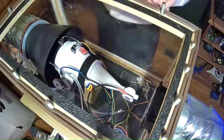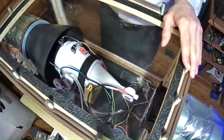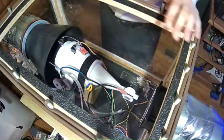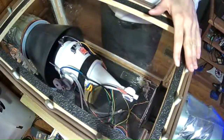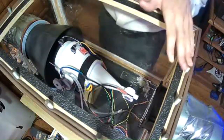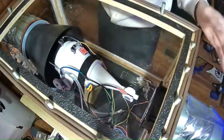With the Peltier modules, the cool thing is that I can control it very well with the computer. I'm going to use a potentiometer, a digital pot, and an H-bridge. The H-bridge will switch the polarity so that I can cool and heat the box on demand, essentially. I can tell the computer I want to cool the box. I don't have to switch anything. The computer can control it. And the digital pot is going to be able to throttle the Peltier modules by lowering the current flowing through them. And so I can effectively maintain a very well controlled climate inside this chamber. And there's a lot more that I can go into detail with the electrical stuff, but this is just going to be a brief overview.